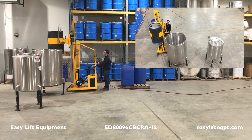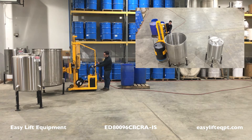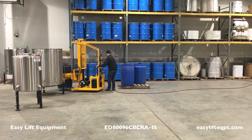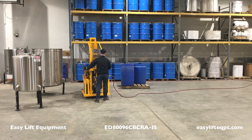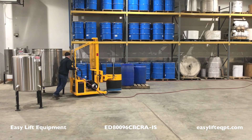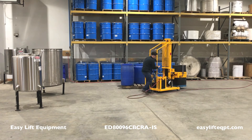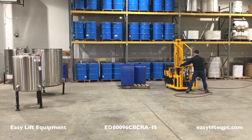Be sure the load is within the rated capacity of the equipment. The load capacity can be found on the specification plate. Be sure that no one is standing near the mast or load when being raised, lowered, or rotated. The mast is equipped with a mechanical stop that is engaged when the cylinder is fully elevated. Keep hands or other objects clear of all moving parts such as the lift cylinder, clamp, and mast during operation. Do not use the unit on inclined floors having a slope of more than 5 degrees.